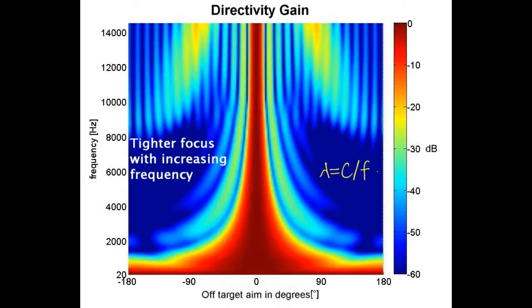I should point out that the higher the frequency, the shorter the sound wavelength. So the effect of beamformer sound addition falls away more quickly for high-frequency sound sources as we aim away from the focal point. A woman's voice focuses more sharply than a man's, assuming her average frequency is higher than his.